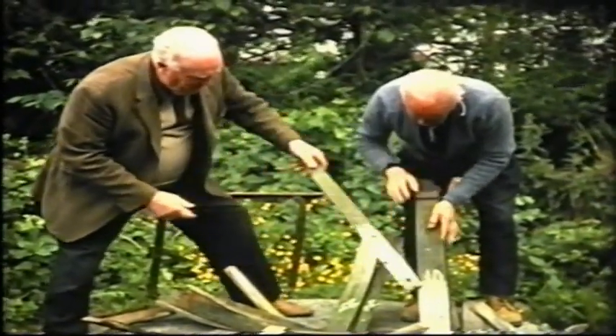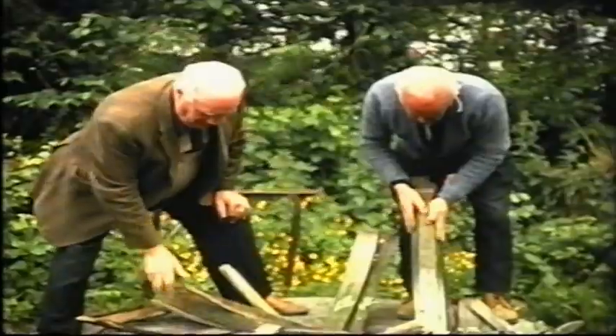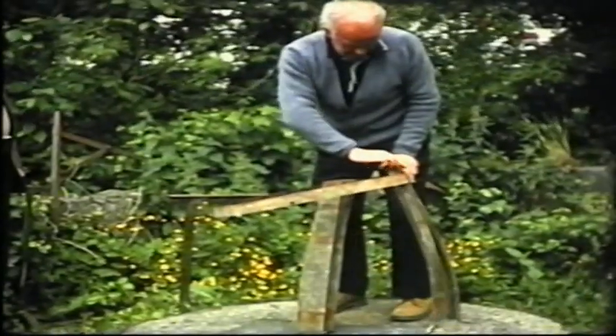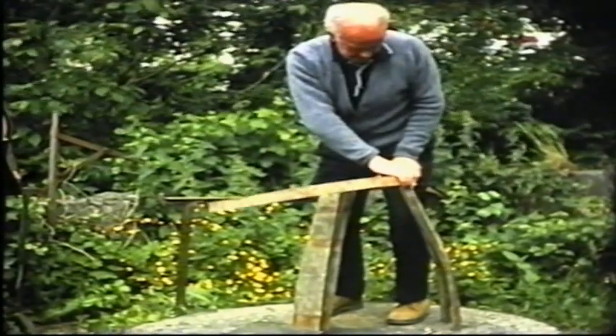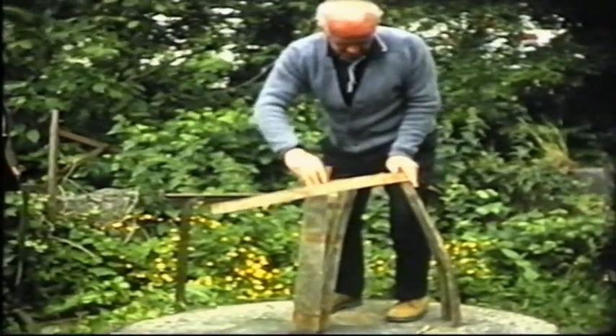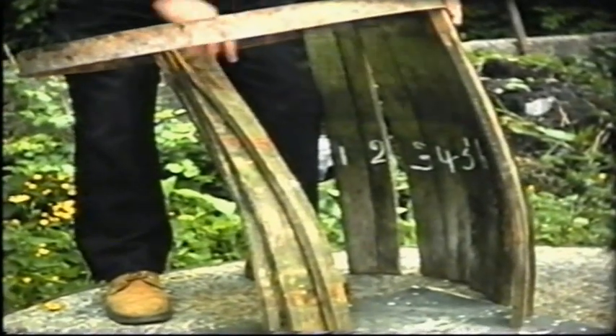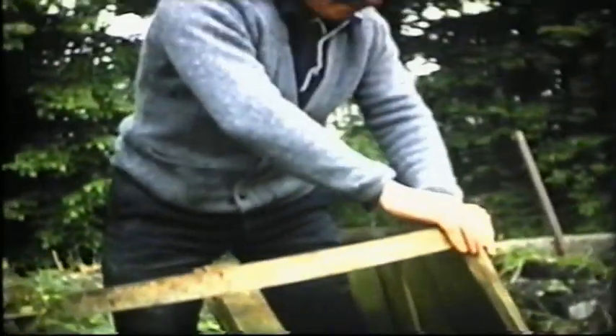The staves are arranged in order and the hoops hammered flat on the Cooper's anvil. When the repair has been carried out, reassembling of the barrel commences by rearranging the inverted staves inside the bottom hoop. In the case of a barrel containing a large number of staves — in this instance 36 — it would not be possible for one man to do the job on his own.